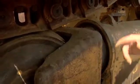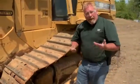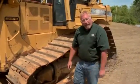If we continue to run this idler, we're going to run it beyond its repairable life, which means more parts to buy. This idler can be chucked up and welded at your local Cat dealer.